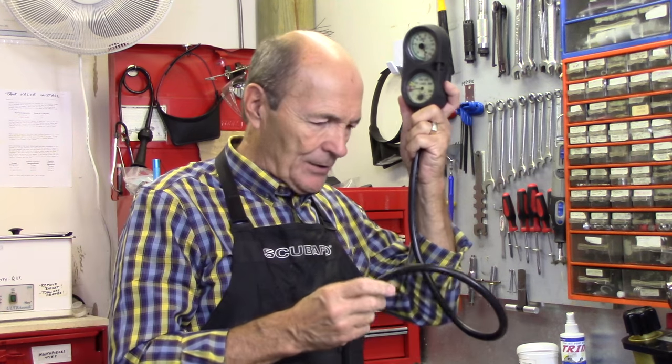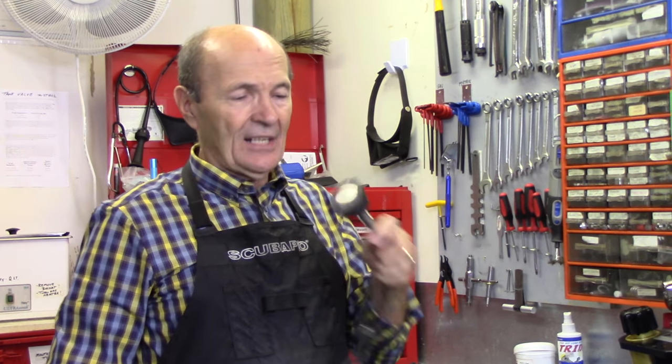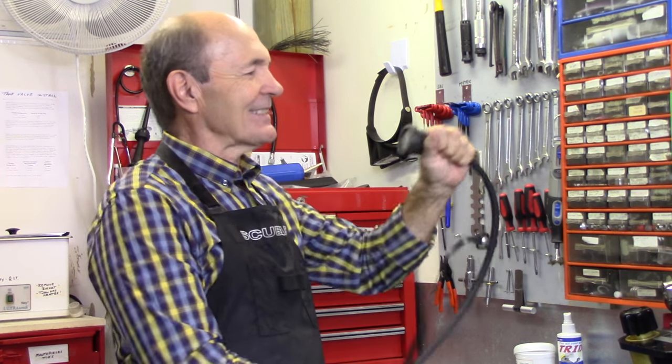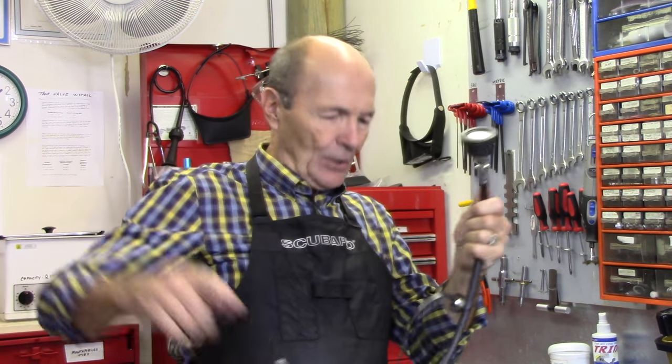Now, not anymore. It used to be that way. Let me show you what I mean. This is a modern gauge, okay? Here is an old-fashioned gauge. This is real. This is from the 60s. This is what submersible pressure gauges first looked like when they first came out. The gauge was on the end, you see? You look at it like this. Kind of weird, huh? And there's no swivel. It didn't turn. The hose went from the new high-pressure ports on the regulators. They didn't have gauges before. But now they had high-pressure ports on the regulators, and a high-pressure port on the regulator had a hole in it, so the air would come out at 3,000 PSI.